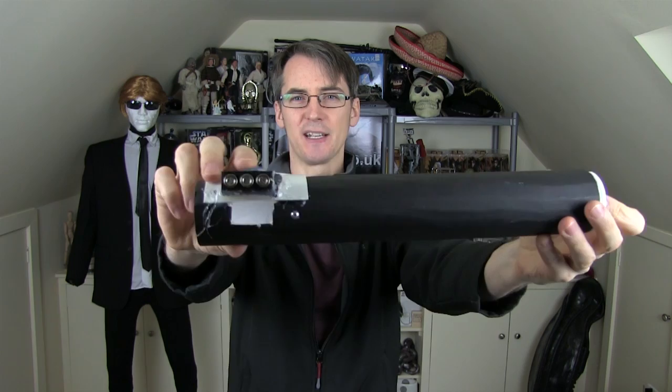The handle is pretty passive. The only cunning feature is a magnetic coupler made of three magnets, linked to the switch, which couples when you put the lightsaber into the appropriate hand. The magnetic coupler connects with the thing on your wrist so the switches can power the motor. We can easily put high-power LEDs into this — we don't need to worry about the power source because it can be a battery box on your belt. We can do the same with sound, putting the speaker and sound generation board anywhere, magnetically coupled.